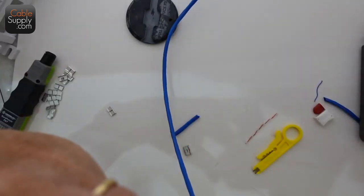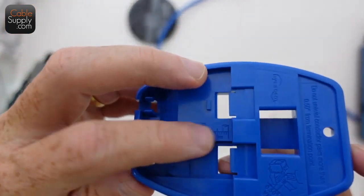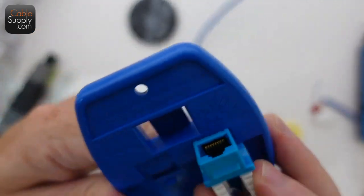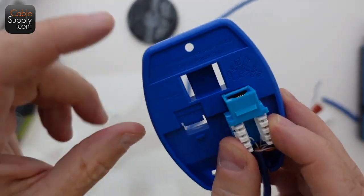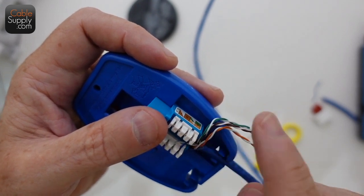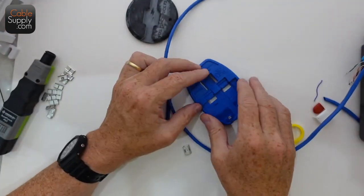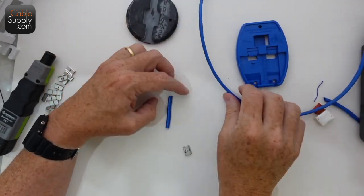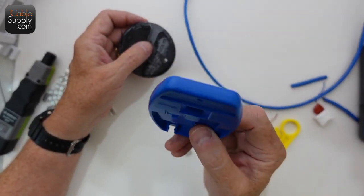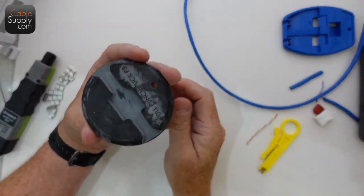It's designed to use in your hand. There's some useful information written on the side about cable sizes, though I never pay much attention to that — I just know how to put a jack together. Different models will fit one of these holes, so that's where you put the jack in. You hold it, do all your distribution, then punch down, or you can set it on the carpet and punch down there. It's a great, inexpensive device that saves time.